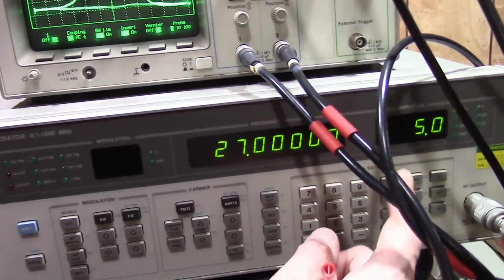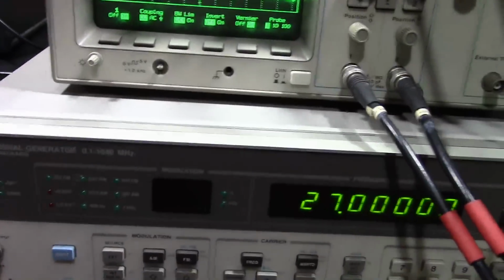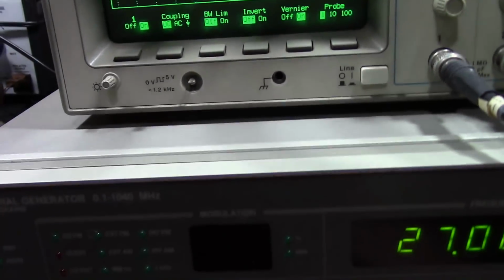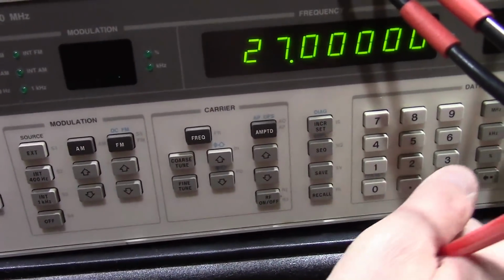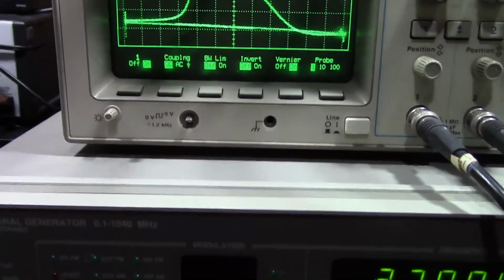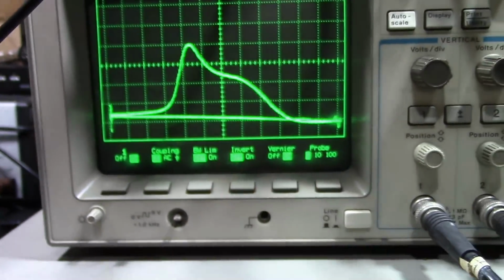Something else I can do is, I got this marker generator turned up pretty darn high. So I am going to, that took care of it. Harder to see the marker now, but I can compensate for that by just cranking up the size here so I can still see it fairly well there. Things are getting a little jittery again, so knock this guy down, maybe minus 10 dB. Actually, I can just turn this off altogether, because I know 27 is right there.